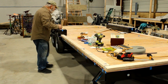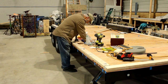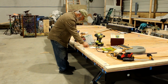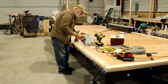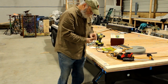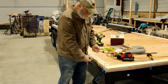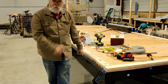I've got a little bit of a gap on the end here, but I want to move that just to be safe. On the underside, each bolt will get a flat washer, a lock washer, and a nut. I just have to get them started — I'm going to reach under there, get them started by hand, and then take my impact wrench and run them up.